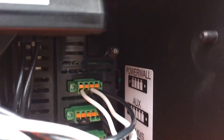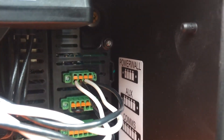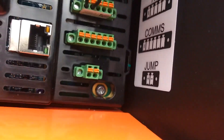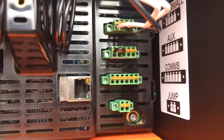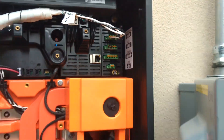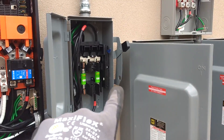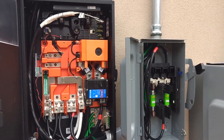This top connector here — you can see the Powerwall communication ports 1-2-3-4 starting from the left. This little aux jumper is the shutdown. If we needed an emergency shutdown we would wire an emergency e-stop button instead of that jumper. But since this is accessible from outside, we can just shut off our batteries using that disconnect and we don't need to add an extra button.